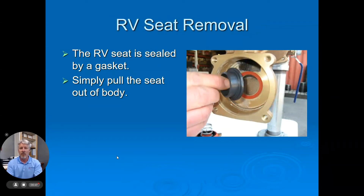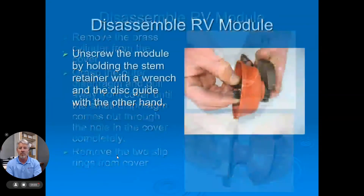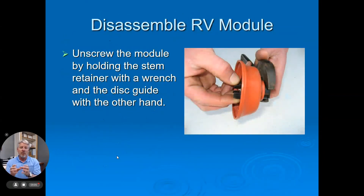There's no thread and no special tools required. Once we have the cover out, we take the cylinder and can actually remove it, pulling the relief valve diaphragm assembly out of the cover at this point. If you tear it out before doing this, you could do damage to your relief valve module. To disassemble the relief valve module, simply unscrew both ends of it — there's one bolt that holds everything together.